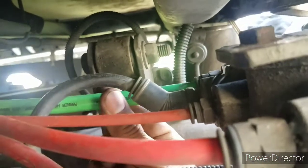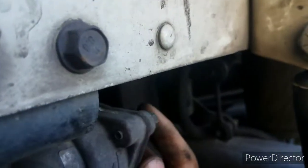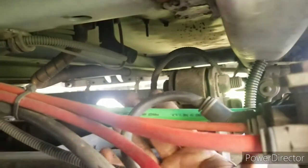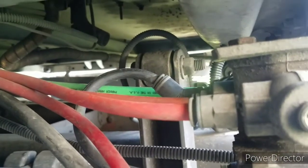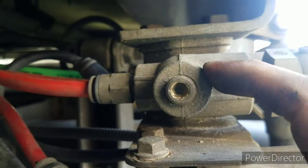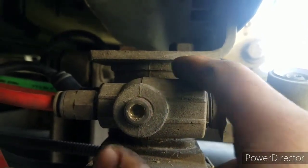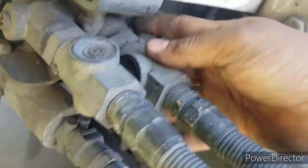This is the line that brings air when you press the pedal, and it goes right on this side right here. When you apply air to the trailer to release the brakes, air comes out this way, and then inside this part — the tractor safety valve — a little spring pushes so the service brake air can get through.